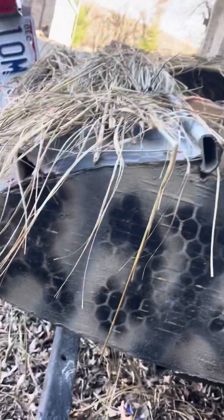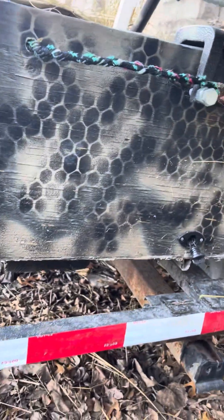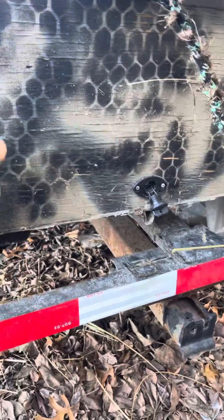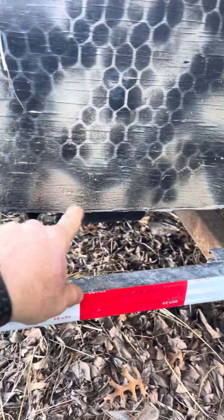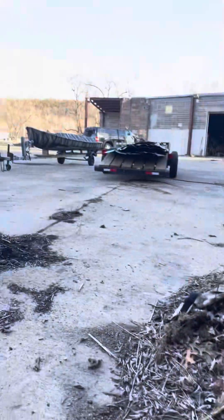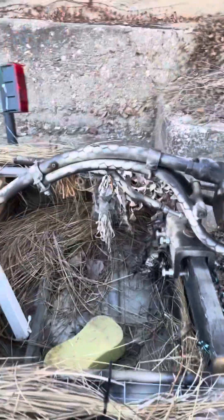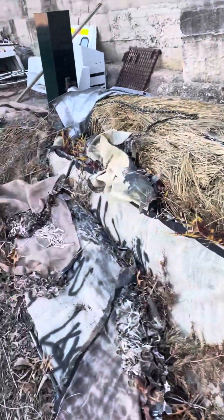You cut the transom down and then bend it over. This one was a little longer so I actually cut about two feet off the back end. This one is marine-grade plywood — sealed it down at the bottom; it did leak a little bit so we sealed it up more. If you can keep the aluminum transom on the back you're probably better off, but wood transom will work fine. His is running almost a 10-horse and it pushes it just fine.